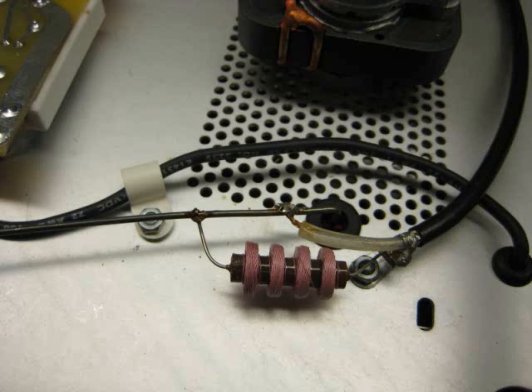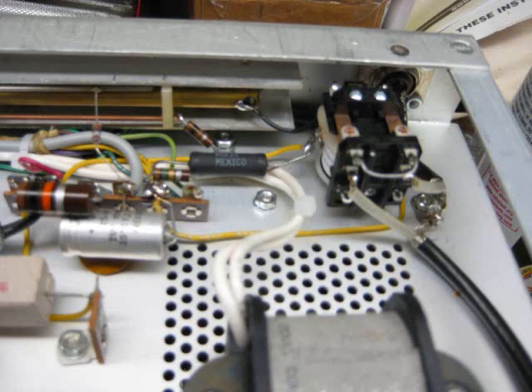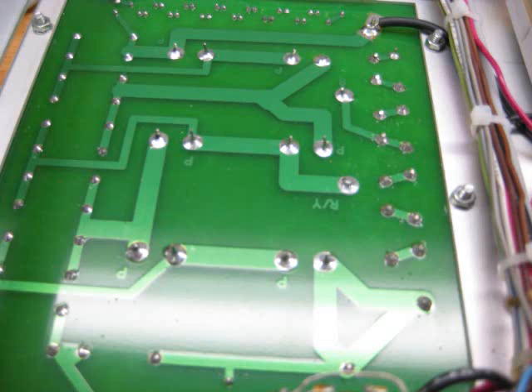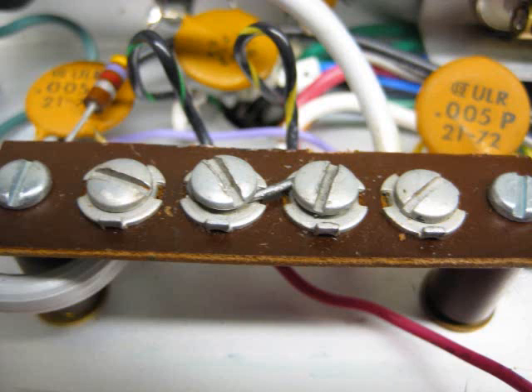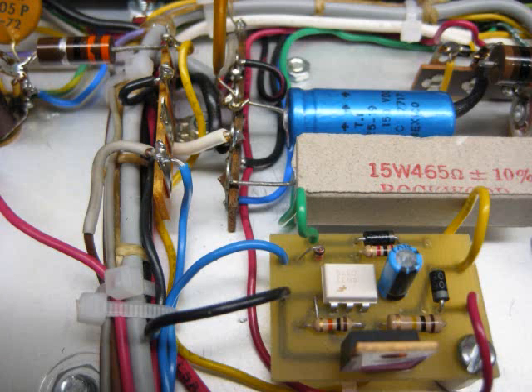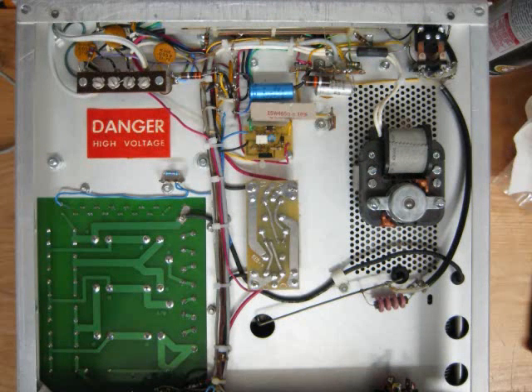Here's the soft key, and that has worked very well. It takes about seven tenths of a volt. Normally on the original, you had to switch 120 volts in order to turn the amplifier on, which would chew up some of the more modern solid-state amplifier switching circuits. It was relatively easy to do when you consider the amount of work that went into this. Indeed, when I first powered it up, I got over 600 watts — and that was on 20 meters. I'm going to test all the bands and record the dial settings and power levels for the various bands, but I'm really pleased. 20 meters was the one I was principally interested in, and it went together very well. A hat tip to Harbach Electronics, who really facilitated this project. I've got about $1,000 invested in it and it took me about four days to complete, so I'm very, very pleased.